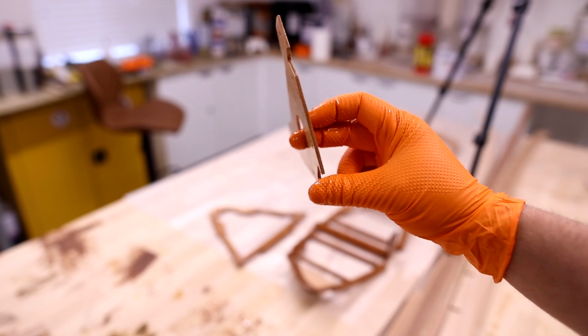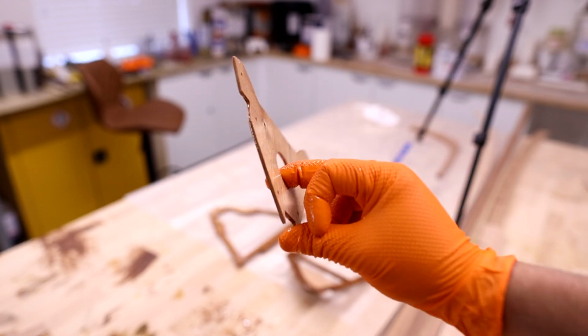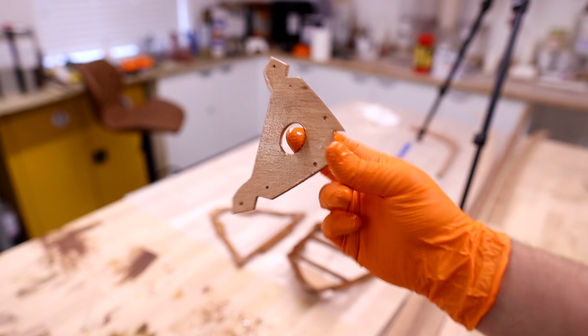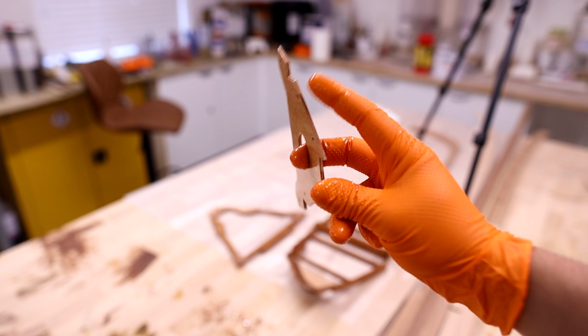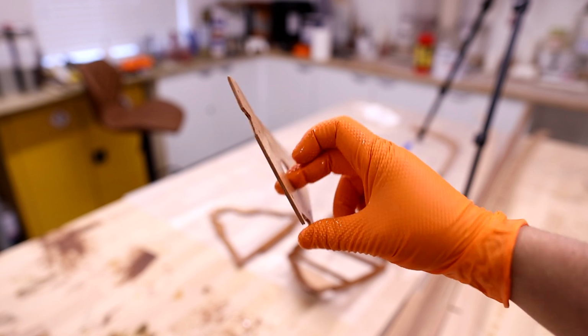There's a typical bulkhead, so I've literally done every single face on that, anything that's exposed. Even if we're going to be slightly reworking these chine landings, that's not going to hurt at all. So you guys know what plywood's like. You want to make sure it's really well sealed because the edges of it are just like little straws that are going to wick up water, so we want to make sure that's really well covered all faces.